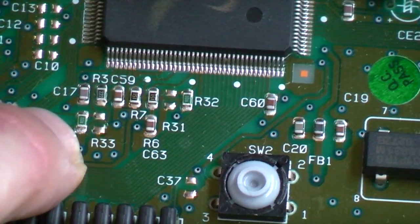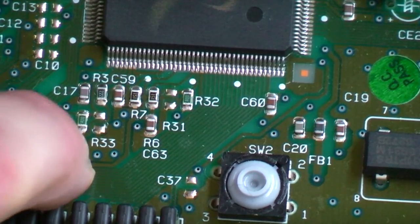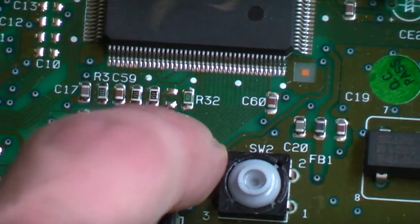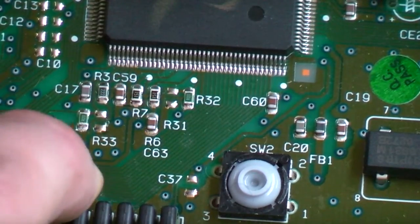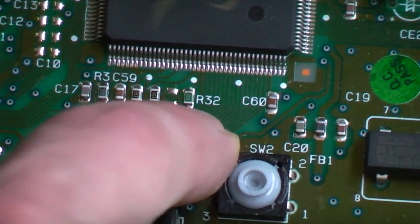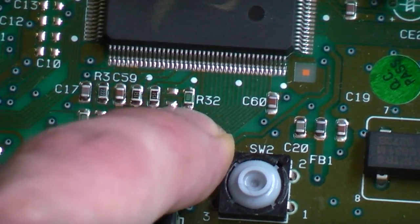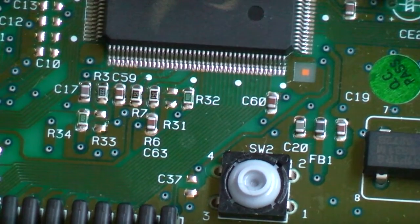This little resistor is what's called a zero-ohm resistor — it has no resistance at all, it's just a link. The first thing we need to do is remove this link, and that way it's going to expose all four points. We just attach some wiring in its place and we can do switching from there, and repeat the same up here. This one down here, which has R34 written next to it, controls your 50 and 60 hertz switching. And this one up here with R32 is going to control your English and Japanese switching.